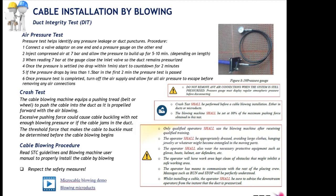Wait a couple of minutes and observe the pressure drop — it must drop by less than 1.5 bars per 2 minutes. If the pressure drop is within that range, the test passes. Otherwise, there may be air leakage in couplers or ducts that you need to re-verify. With these four tests, the duct integrity test is complete.